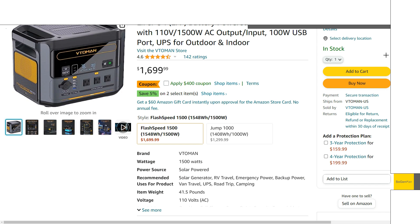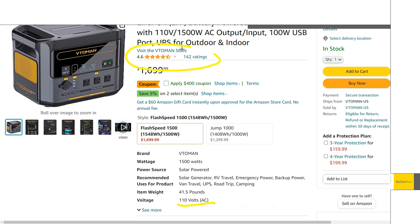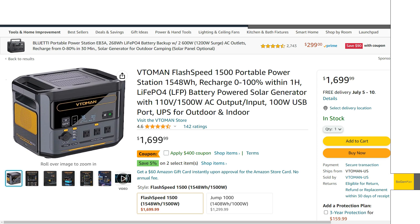Just a few last notes: 41.5 pounds — for these specs, that's pretty good. The one thing I am disappointed to see is 110 volts AC output. It should be 120 volts. Now, is it going to run all your appliances safely? Yes, basically anything above 108 volts is going to be good. But just be aware — you don't want to be using some super long extension cord with this thing, because then you could have the voltage drop a little bit further. Also, they basically added this new unit to their existing listings, so it doesn't actually have 142 fresh ratings on this brand new unit. Hopefully you found this overview helpful and interesting — thanks for watching.